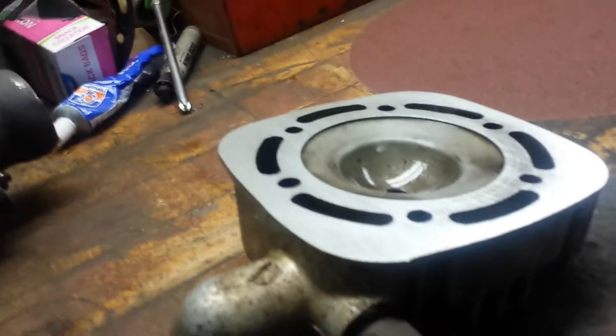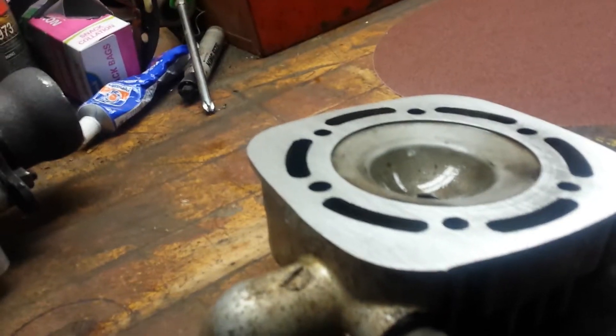Okay, so that took all about three to five minutes. With 80 grit, you don't want to take off a lot of material. You basically just want to get it close, and then finish it off with 120.